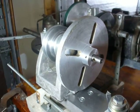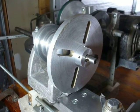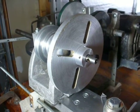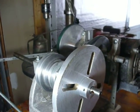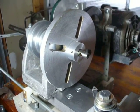So this headstock I'm just kind of considering as a temporary step right now. Once the faceplate's done, I'm going to cast another headstock and set of bearing caps, and then I'm going to rebore it. But this time I'll actually have this headstock and a good set of pulleys and everything, so that machining operation should go a whole lot smoother.